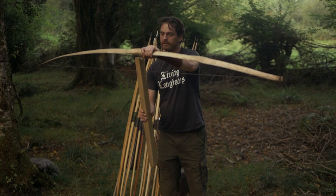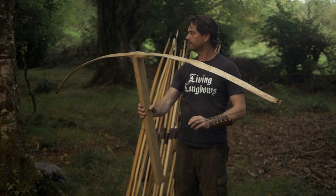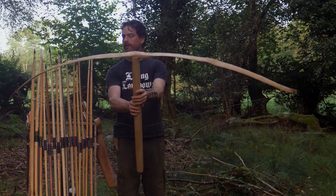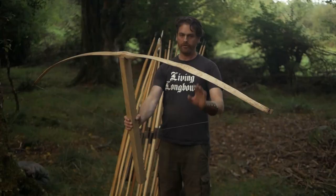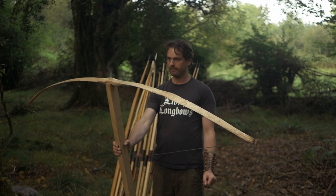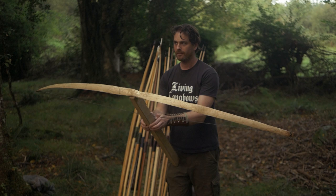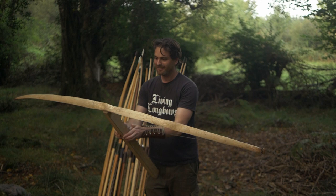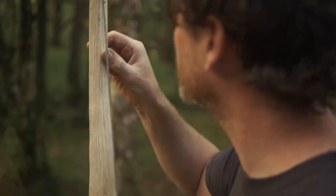I've got 20 inches marked on the tillering stick. It's very stiff through here — but it's got a twist in as well which makes it tricky. It's nicely bending, maybe a little bit too much at the tip, but you can probably adjust that. The bottom limb needs to be slightly stiffer usually because it's slightly shorter. It probably needs a little bit of tweaking and finessing, but still functional. Have either of you tillered to your full draw length? No. Okay — danger zone right here, uncharted territory.